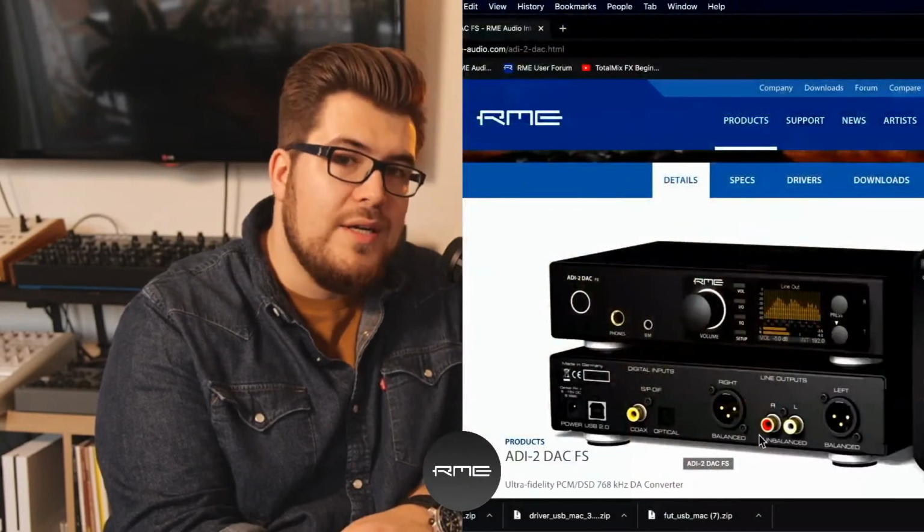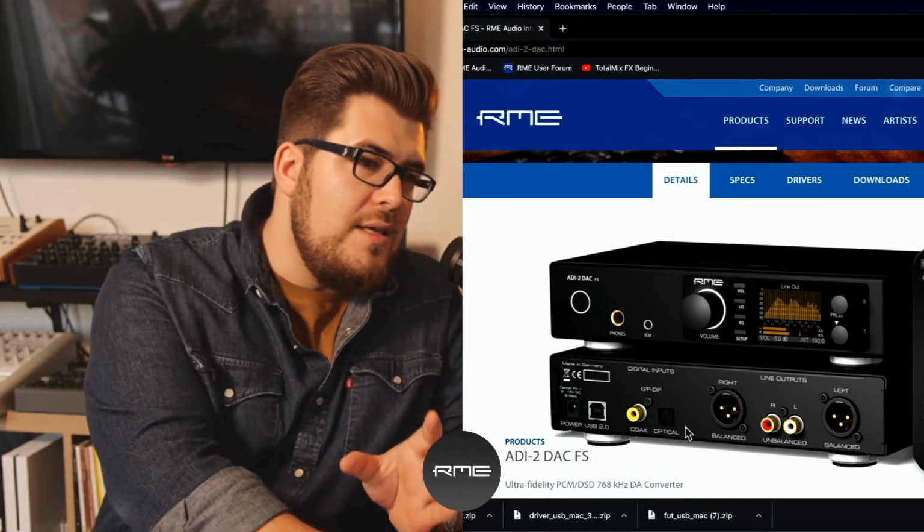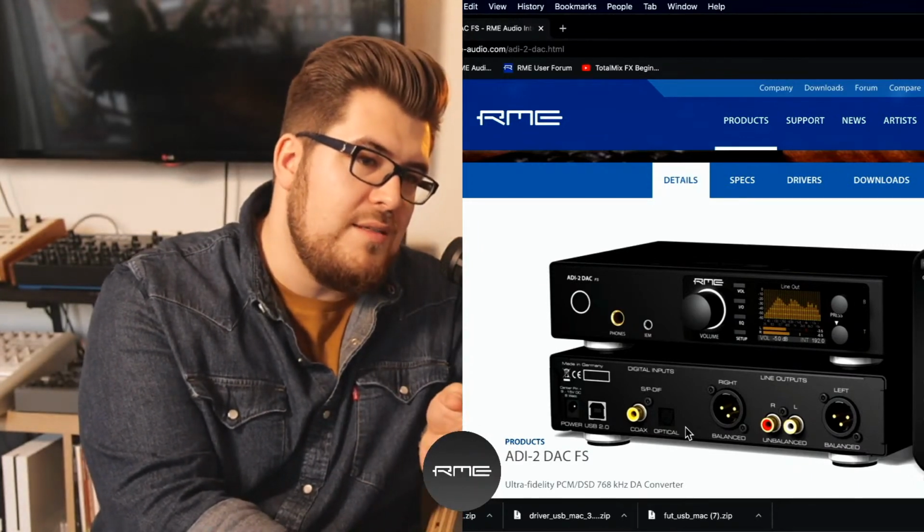We have another question from Patrick Post Music, and he wants some real-life examples for using ADAT with the Babyface Pro. One feature that I use the ADAT ports for is to integrate the ADI-2 Pro or the ADI-2 DAC into TotalMix effects. The ADI-2 DAC doesn't have TotalMix, but when you connect it via ADAT or SPDIF to the Babyface Pro, you can route signals to the ADI-2 series like any other device. That is pretty awesome because you have the great sound and the amazing headphone amps while having the flexibility of TotalMix effects, and I think that's a great benefit.